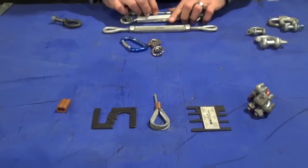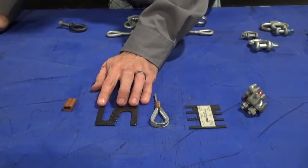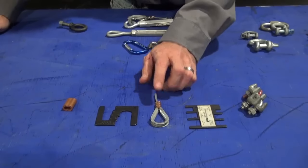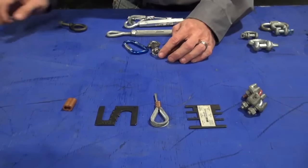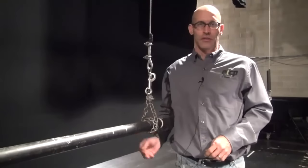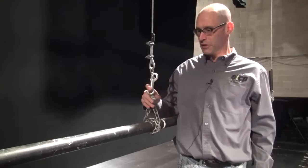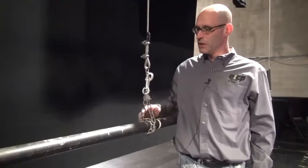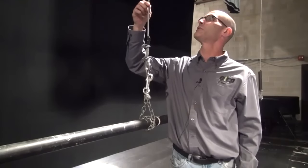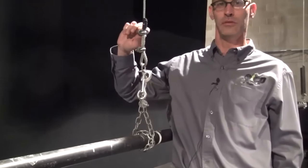When making your own swages, have a go-no-go gauge that matches your tool and check swages frequently. When the tool gets off, it requires readjustment — all tools are adjustable. Now let's look at stage hardware applied to a rigging situation. Going from the top, we have our quarter-inch wire rope lift line terminated with a thimble eye and two cable clips.